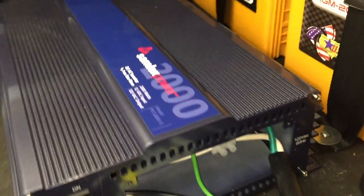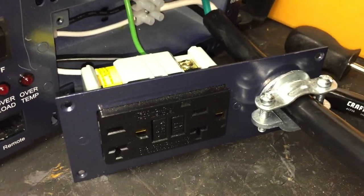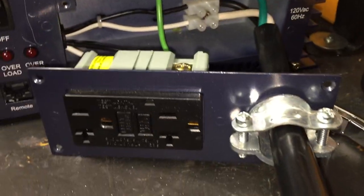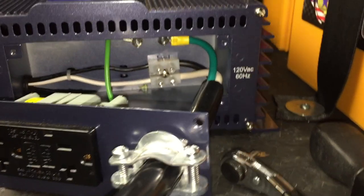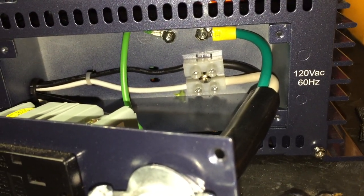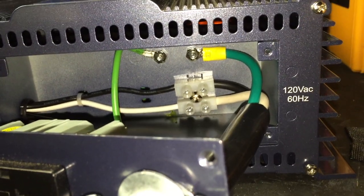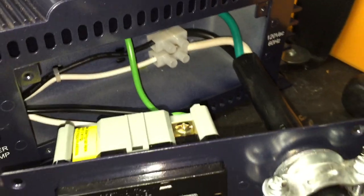This is the hard-wire setup for the inverter, the battery banks, and this new hard-wire plug — straight 30 amps. I don't have to use the dog-bone pigtail connection to the regular plug anymore. It's the standard RV plug. Wiring is pretty straightforward: white to white, black to black, and green to ground. It's tight quarters but it works.